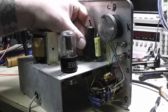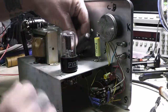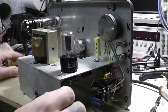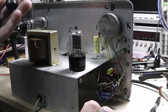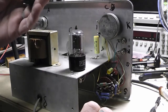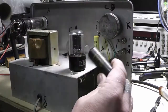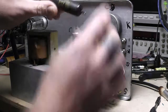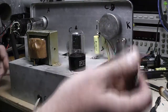So maybe it wouldn't even fit in there, so they went with what they had. I moved that over, screwed it down over here, and replaced it here with this capacitor. It's the same thing — this is a 0.22 microfarad, that one was also 0.22 microfarad. This one is 600 volt and that was 630 volt.